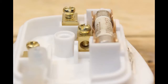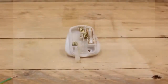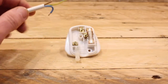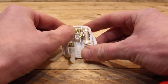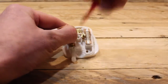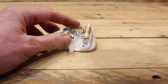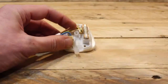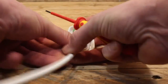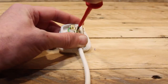When you get the plug, you'll notice that all the terminal screws are down so you can't actually get a wire in. Go around each one of the three and unscrew them. Now take the wires that we've prepared and pop them in, making sure they're all nice and tight. Take your earth, which is the longest one — generally it's easy to do the longer ones first. Screw it in nice and tight, making sure you've got no exposed wires anywhere. Then tidy up the blue and pop it in, making sure that's nice and tight. Flip it over so that the live will go in nice and tidily, and screw that up nice and tight as well.